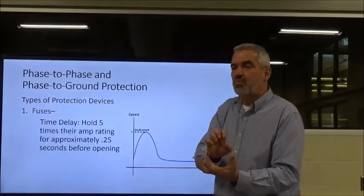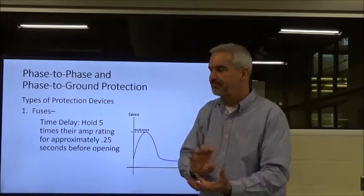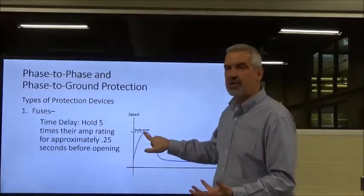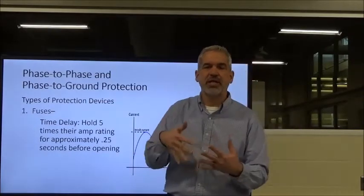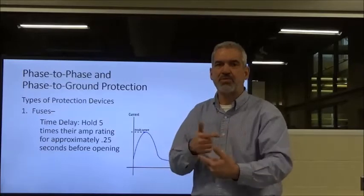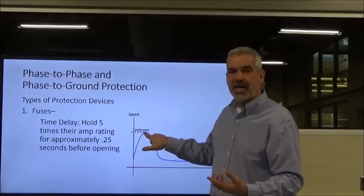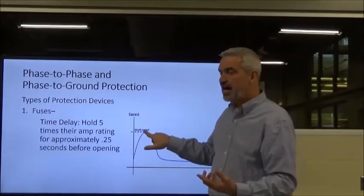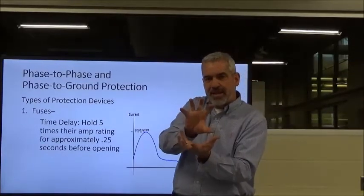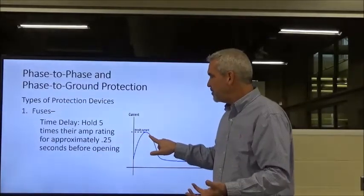Okay. So when that happens, we basically have voltage applied and the rotor sitting still. And our current goes up extremely high because we're not cutting those lines of flux in the magnetic field to get that rotor to turn. So for a split second, we have a very high inrush current. Our current goes very high. But the moment that rotor starts to turn, that first degree of rotation, our current starts to come down.